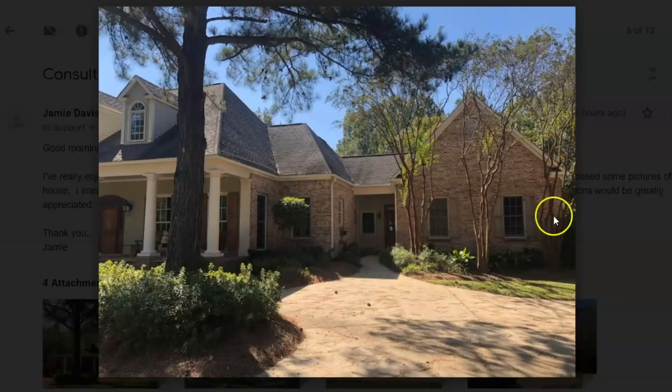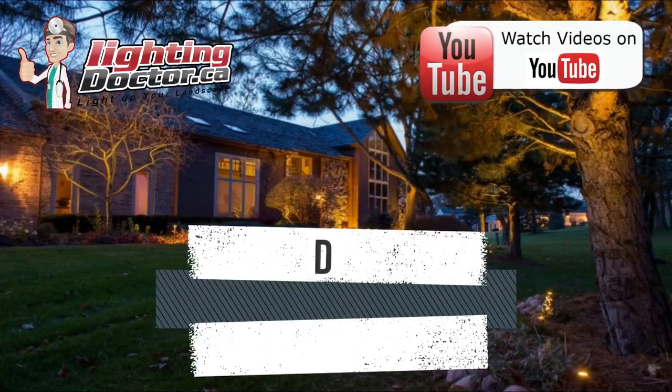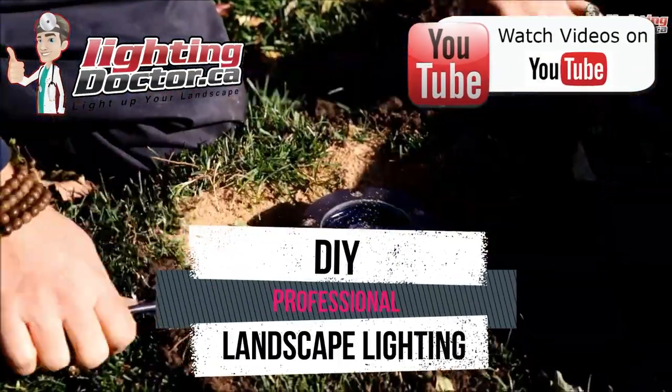Bring the lights back a little bit further, still have them shining fairly upright. The reason being is if I can splash a little bit of light and cast some shadows and still light up the brickwork especially at the top, that's something I would want to do. If you light these three up and it still seems too dark back here, then I would probably put one up light in this middle section close to the house that really just highlights the stonework.